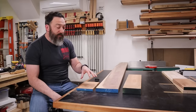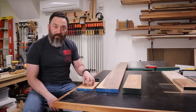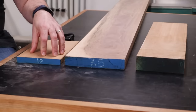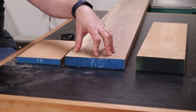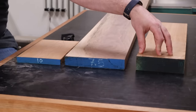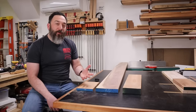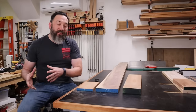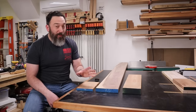The first thing you need to know is that the thickness of the board is always referenced in quarters of an inch. A one-inch thick board will be listed as four quarters. Something that is one and a half inches will be six quarters, and a two-inch thick board will be listed as eight quarters. That's just the way they refer to things — it makes the math a bit easier and it's been done that way for generations, so just accept it.